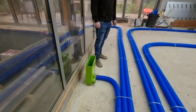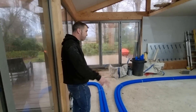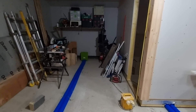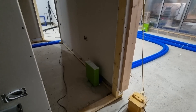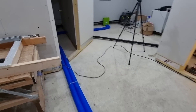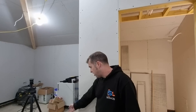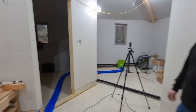We've got a total of three supply air outlets in the largest area for good airflow, a single outlet in the small room with two pipes running into it for sufficient flow rate, and the last ones had to go a different way to avoid a waste pipe across the floor. That's the flexibility of 75mm ductwork — you have the ability to move it around obstacles like waste pipes and conduit, much easier than navigating rigid steel ductwork or large-bore ductwork.